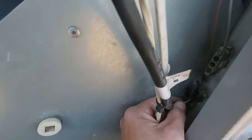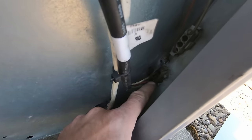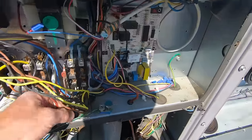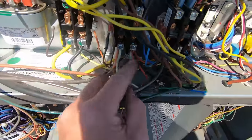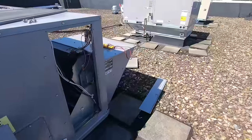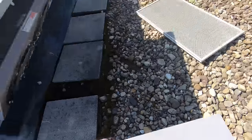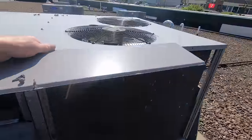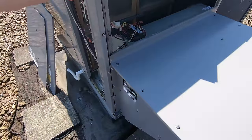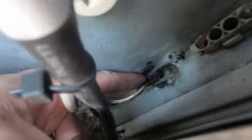I'm not sure if we just had a loose connection here at this plug or if the motors are bad. We are tied in to each leg - red, black, and white on each leg of the 460 coming in. I'm guessing we either have a bad motor or we had a loose connection at the point where the plug snapped together. Heat will melt the wires - next thing you know you've got a wire melted off. And it arced right against the side of the panel.